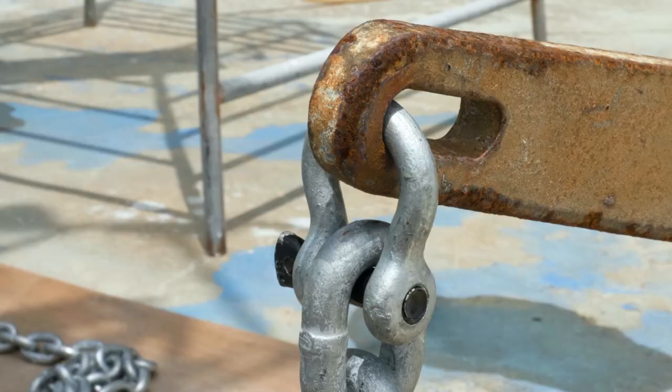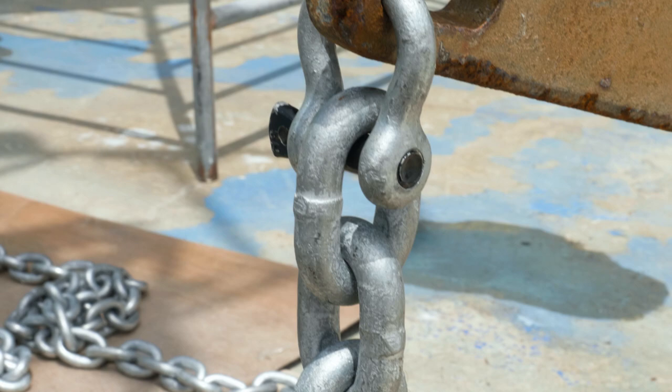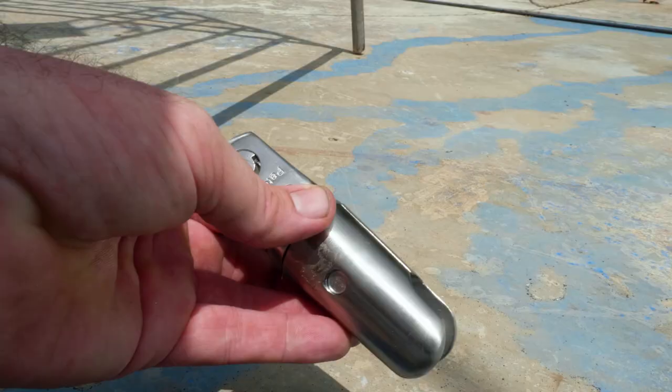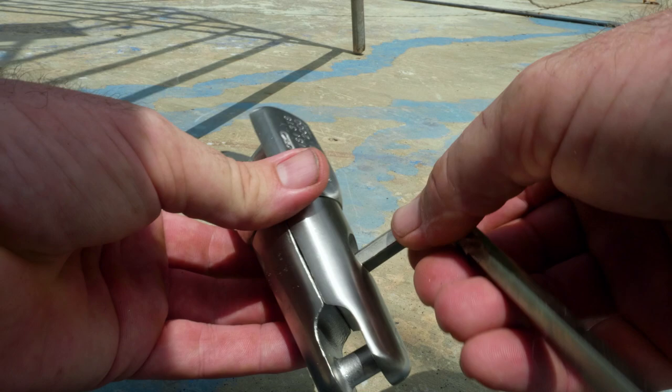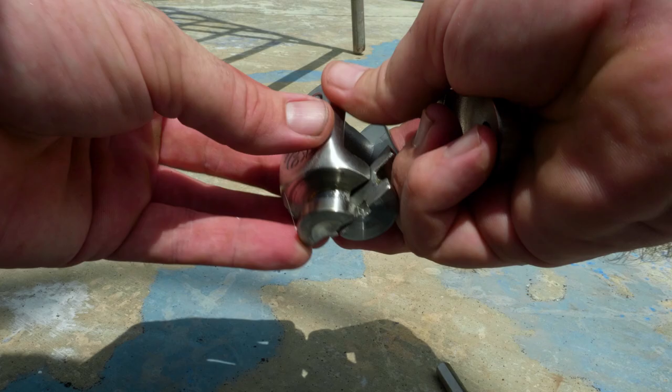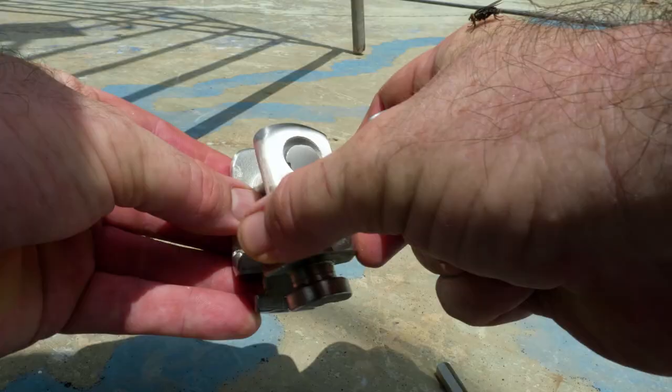It's also pretty important because of the big crossing we're going to do and all the anchoring involved. While we did that, we beefed up all of our ground tackle. We brought the chain through East Marine, who very kindly gave us five links of 12mm chain. Our normal chain is 10mm, but we've put 12mm chain between the anchor and the swivel. Now swivels are a very divisive subject — lots of people will tell you they're not a good idea. If you go over to Viv Cox's website, he actually did some tests on swivels and found a lot of them are bad news.